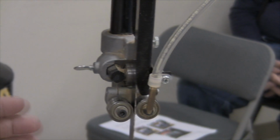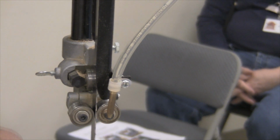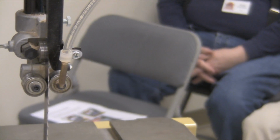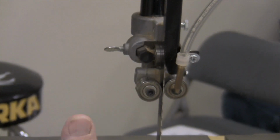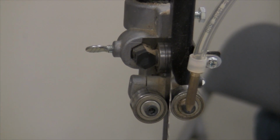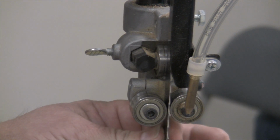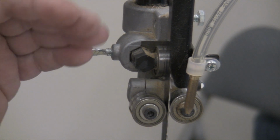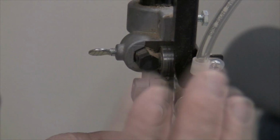And anytime you push it on the wood one way or another, where you force it any direction, you'll put that on. Now, the idea is if you can get this with a gap in between there, and you're cutting your wood, and you're being accurate enough that you're going through there, you shouldn't be hitting one side or another. If you're twisting it a little bit, you know you're doing it the wrong way. If you're making a bearing move, you're doing something wrong. Now, the back bearing is going to move, because as soon as I put just a little bit of pressure, that back bearing's turning. But you need to have it like that. If you can't solve the problem by backing the bearing up, you already have a gap, because then your blade is going to be flexing when you do it.